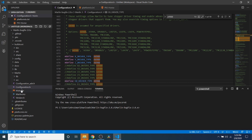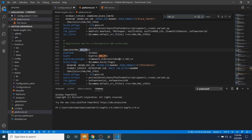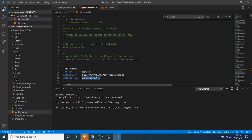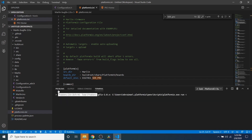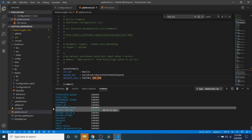So we're all set here for the moment. I'm going to go over to platformio.ini — currently our chipset is the mega 2560, so we need to change it to the one we're using. We're going to search on skr_pro and copy bigtree_skr_pro. Then we're going to go back to the top, highlight mega at mega2560, and paste our chipset. Then we're going to do a build by clicking the build button, which may take a few moments. Now that the compilation is finished, we can confirm it says successful.